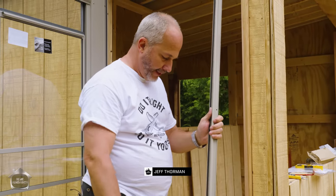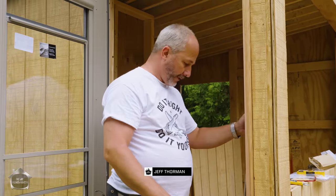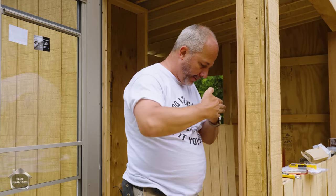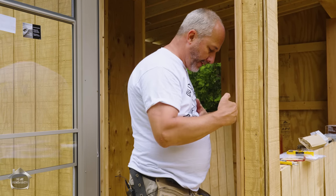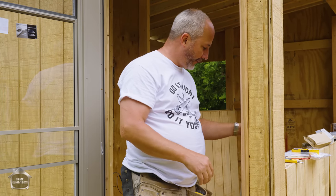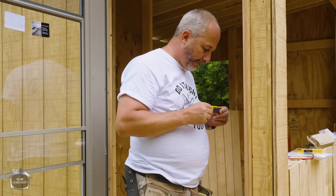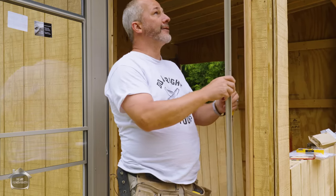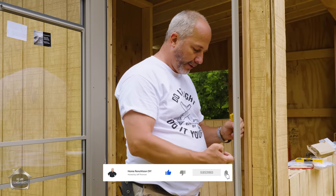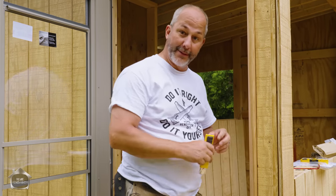So this door trim has this ridge here and it adds thickness for no reason at all. And it's making this a little bit more difficult than I wanted to. Because this wood's installed on a bit of an angle, and it's as far as I can pull it tight this way, without backing out these screws and shimming from the backside, what I am gonna do is take it from this and this. I'm gonna pivot the front. Essentially I'm gonna take this piece of metal trim and twist it like that, so then the door closes past this corner. Yeah, I just need a couple shims to get that done.